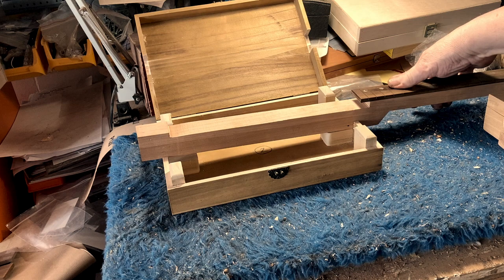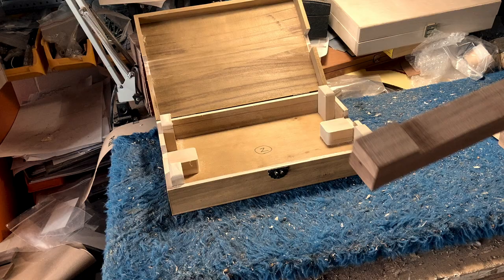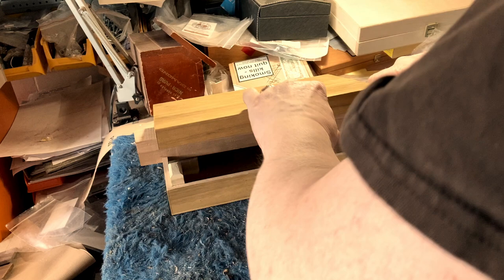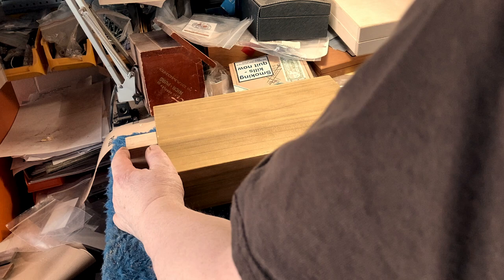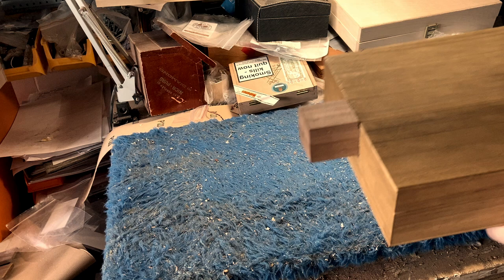You can see it's cut out top and bottom with a block that we just screw through, and we put some fairly heavy blocks in the corners so we can put in strap buttons and it keeps everything rigid. That just drops in there, top on, and because of the way we do this we can just shuffle that around — it allows us to have this overhang here, which makes it a bit nicer. That's the way we normally do it and you can see we get a fairly tight joint. I was thinking about whether there are any other ways of doing it.